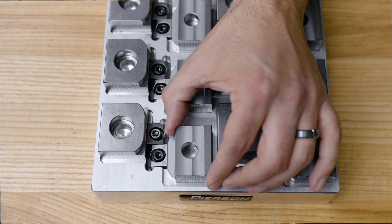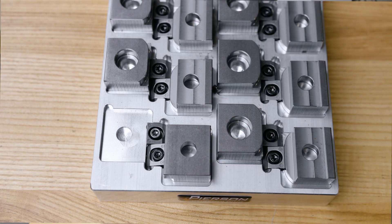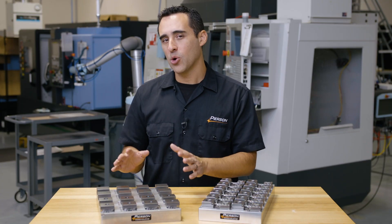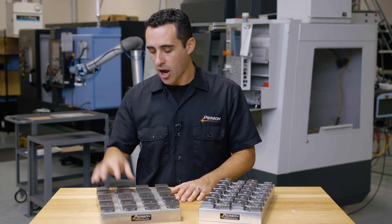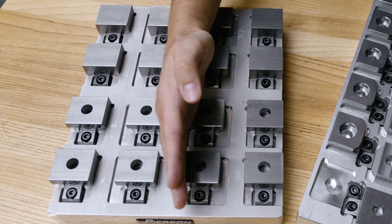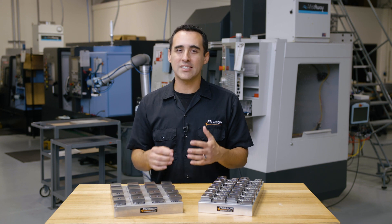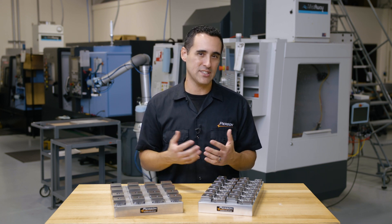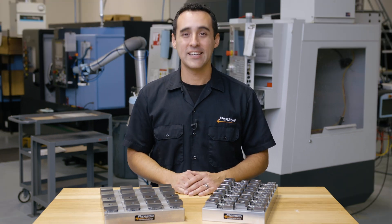Finally, notice how we simplified part swaps. Alex removes all of the finished parts first, and then flips over the first parts just an inch away. The issue we had with the old pallet was that we would remove a quadrant of parts and then had to replace them with the opposite corner, because they would locate towards the center off the same datum edge. We couldn't just randomly place them because we would have been locating off two different surfaces, and the chamfers wouldn't have looked right on the second operation.